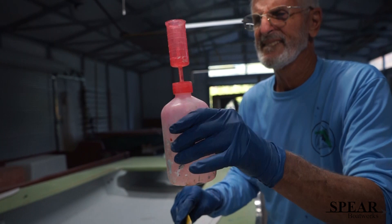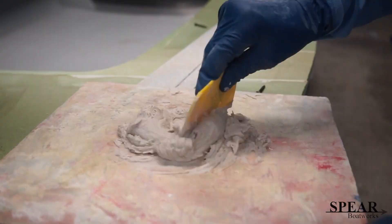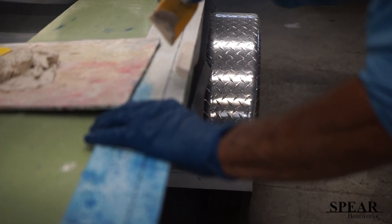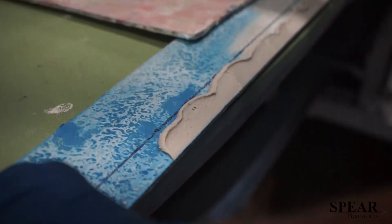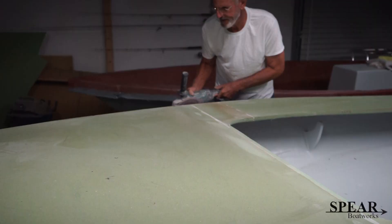Yeah, getting ready to be glued — same B39. I try to mix this stuff up with about two percent catalyst, which is plenty. It gives you enough time to work and also fires it off relatively quickly and really hard. Then cleaning off the inside edges.